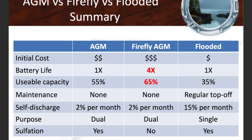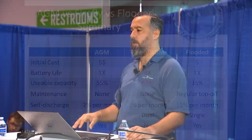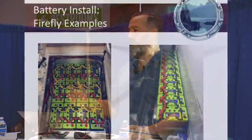The way you do that is having a battery tolerant to a partial state of discharge. That's why some boaters will choose a Firefly battery, even though it might be three or four times the price of a flooded battery, because they know they're living in that partial state of discharge all the time. A 200 amp hour battery is not 200 amp hours of usable battery capacity — what you see is not what you get. Discharging batteries too deeply will give you a very short battery life.